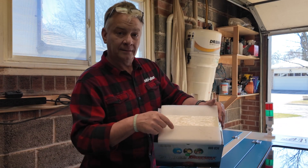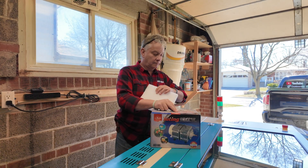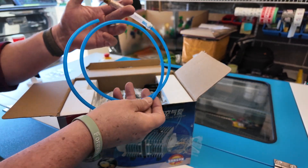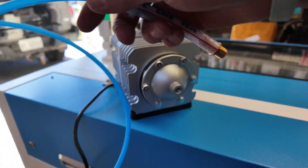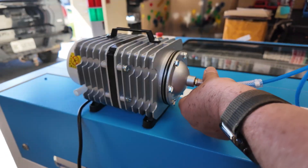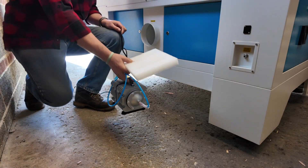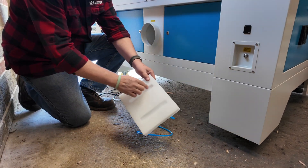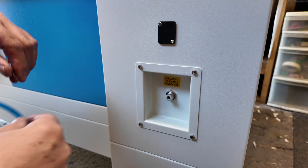I'm going to install the air compressor first. That air compressor will have a very dense foam piece taped to it — don't throw away that piece of foam. You're going to want to sit your air compressor on top of it on the floor so it helps to absorb any vibration. I considered putting some thread tape on the connection, but I just put it in finger tight for now. If I find it's leaking, I'll unscrew it, put some thread tape on it, and put it back. I did not use a wrench — just finger tighten it nice and firm. I'm going to put it down on the floor underneath the laser. The design of this cabinet has enough space on the back that I can roll the cabinet over top of the air compressor as well as the exhaust fan, which means I can get it closer to the wall.